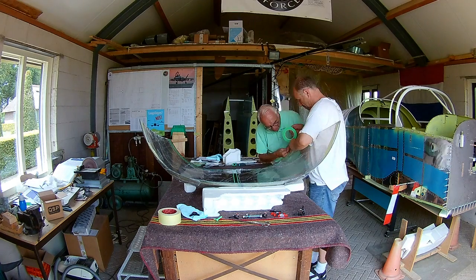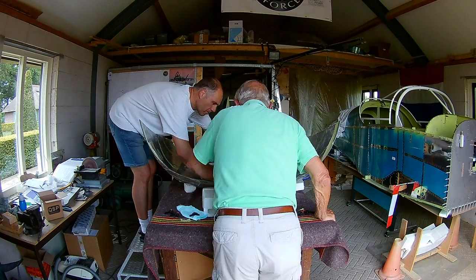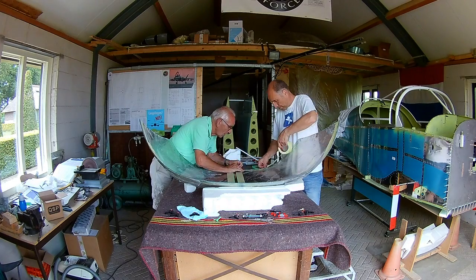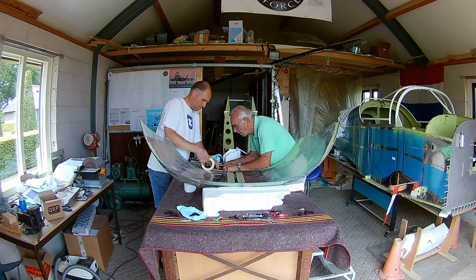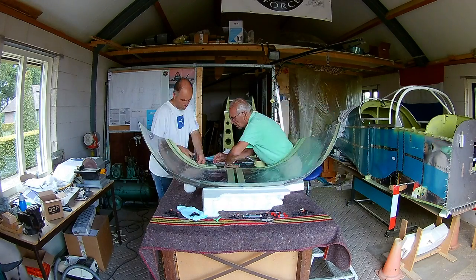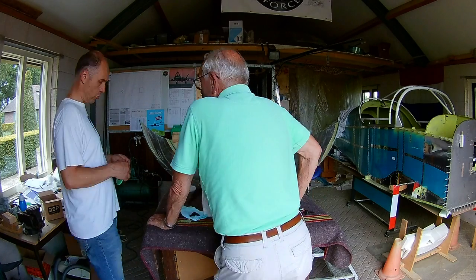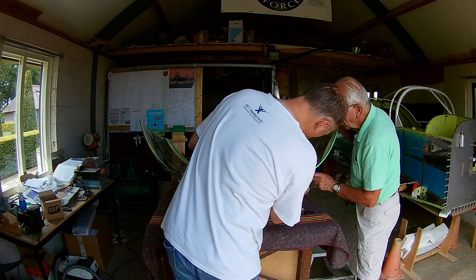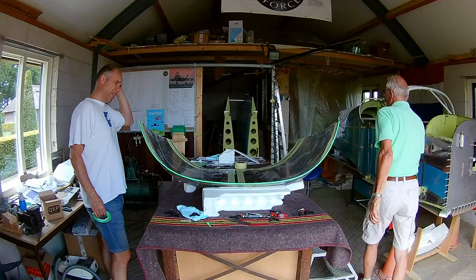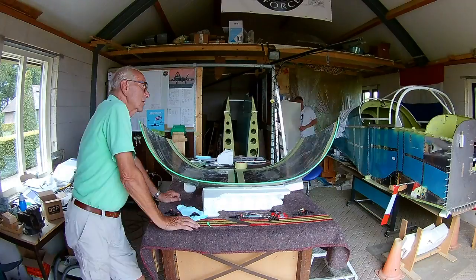The first part is using the fine tape, and we use painter's tape besides it. Fine tape is very fine, as the name says, and it prevents the primer from leaking. But you could still cross that line, so we use normal painter's tape to protect the rest of the plexiglass. As you can see, we also do the top part and the edges, because you don't want the primer to spill. Because once the primer is on there, you will never get it off — it just bites into the plexiglass and there is no way to recover it.